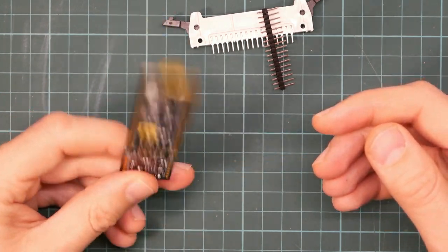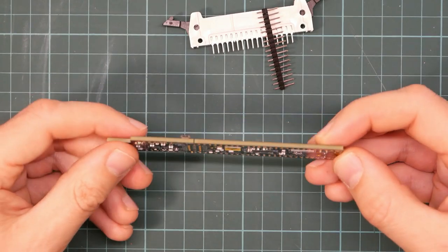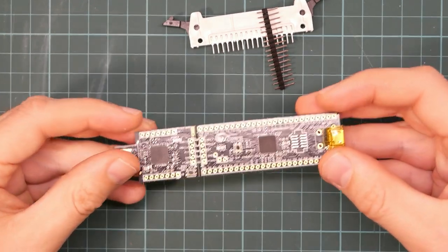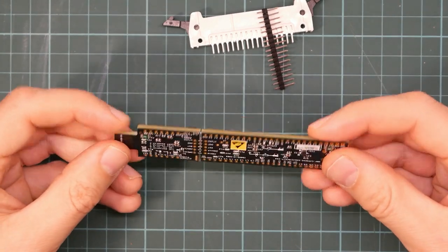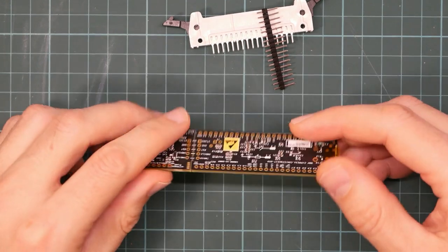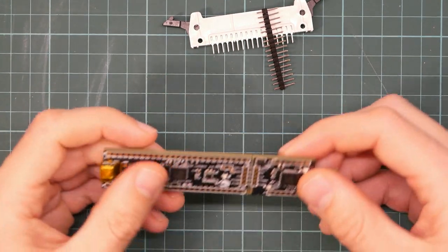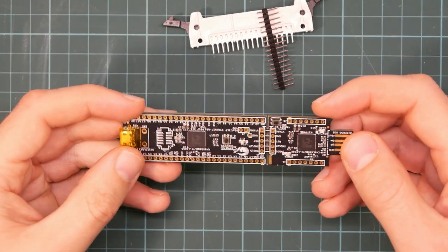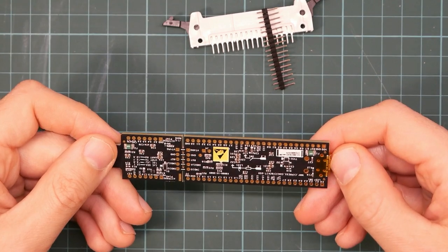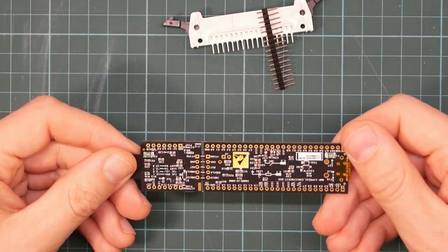The FluxEngine currently supports Acorn, Brother, Amiga, Atari ST, Apple Macintosh, and of course IBM PC formats of disk. If anyone has any samples of weird disk formats you want to send me, I can add more. It'll also read CryoFlux dumps, so if you have any of those too, please let me know. It is capable of writing to disks, but this is harder to test as I need actual hardware. So right now, only Brother word processors work.